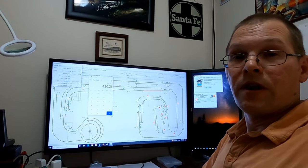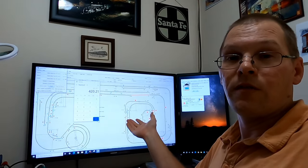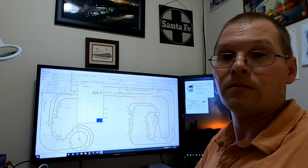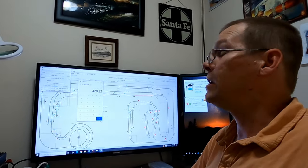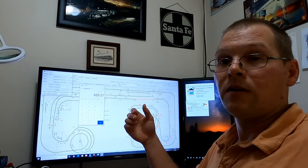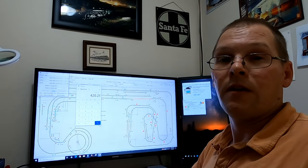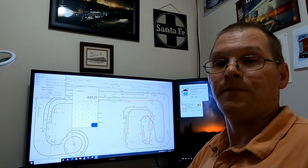So that's a pretty simple and straightforward speedometer that's already built into JMRI, using whatever track detection you've got on the layout. You just set up the sensors it's going to use for the timer and the scale distance for whatever scale you're using — HO, N, O scale, or whatever. It's a pretty easy way of getting a speedometer built in that you can use for speed matching, or the dispatcher can watch it and monitor train speed around the layout. If you have any questions, leave them in the comments below. Don't forget to subscribe, like this video if it helped you out. See you guys next time, thanks for watching.